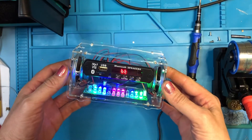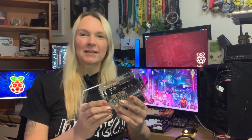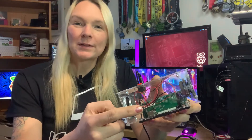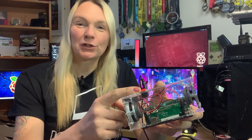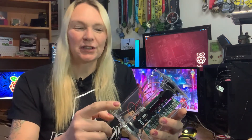Now the kit's finished, a couple of things that weren't obvious in the instructions. There are three connections on the Bluetooth module: the red one is your power connection going to the barrel jack and switch, and the two white ones are for your speakers. There is a plus and minus indication on the speaker terminals when you solder your wires on. The only thing not apparent from any instructions is where to connect the PCB you've soldered — I ran the two wires to the ground and the 5V rail, which seems to have done the job nicely.